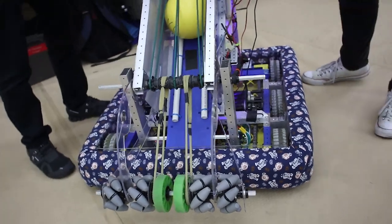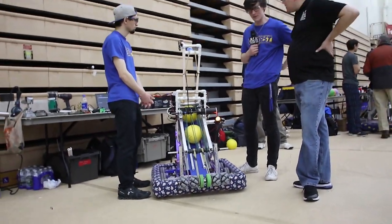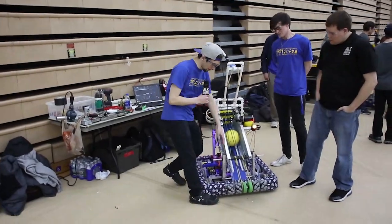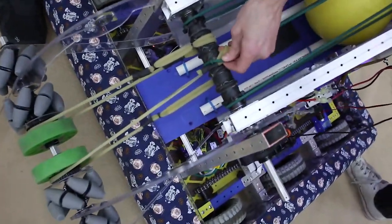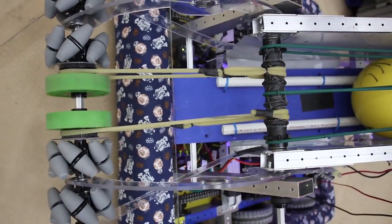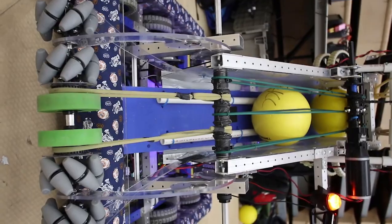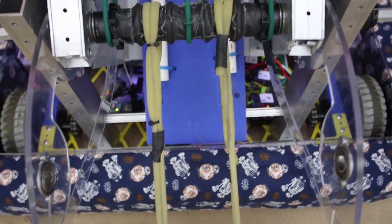That has been one struggle, but we are quickly adapting during the competition and changing some stuff up, making sure that there are no intersections or collisions, so we're going to be able to collect power cells pretty well. Adding on to the intaking: because it's just run off the surgical tubing and it's free moving, we've had issues with it sometimes coming under and getting jammed under our inner tube if we grab the ball from the side. What we found is that during the match, if we see it start to jam — you can hear it, it's really loud — we can just tap the intake button a bunch, it still gets the ball in, and it actually starts to move the surgical tubing out to the side. It's really easy to see from the driver's station, so we haven't had jams like we did at our practice field.